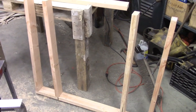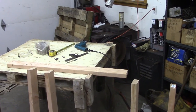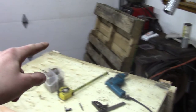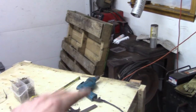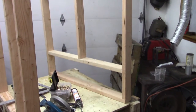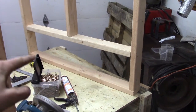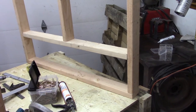I'll do a similar thing for the small chicken door and make an allowance for the nesting boxes in the back. I'll have a long door that I can flop open from the back side of the coop so I can take the eggs out that way instead of reaching all the way through from the front. Here I have the back wall framed out with an open bottom section where I'll put the egg access door.